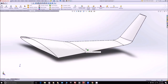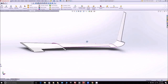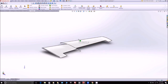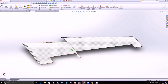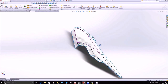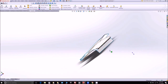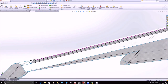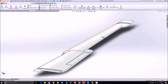This shows what we're starting out with — the basic upper and lower skins. We strip that down to just the upper skin including the winglet, but we're not going to mill the winglet at the same time — that's going to be a separate plug so we can create a separate mold with a joggle so the parts overlap and bond together nicely. So we're left with the upper skin: outboard wing and the inside rear part of the strake. We then add all the flanges, fill in where the flap is going to be as a flat surface, and handle the leading edge by making it stick out so the mill runs under there instead of doing an undercut.